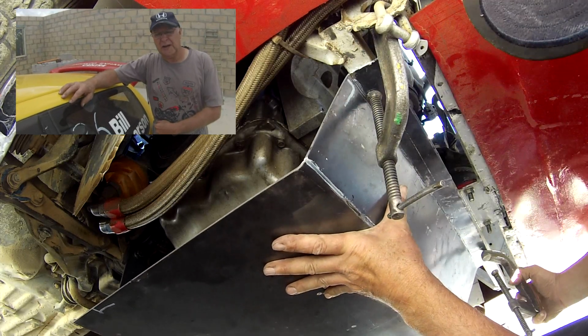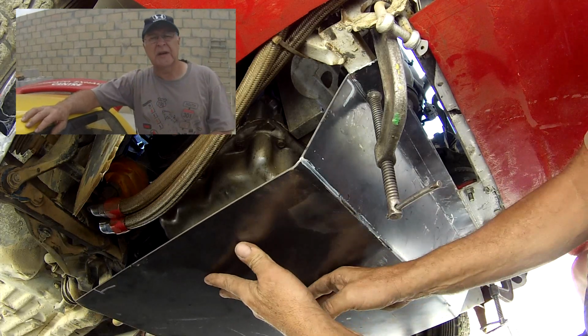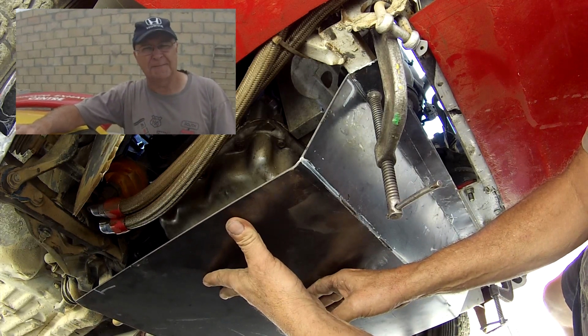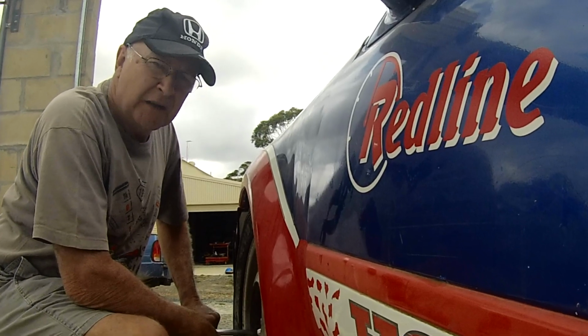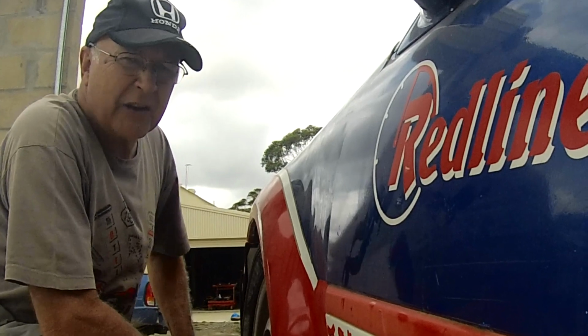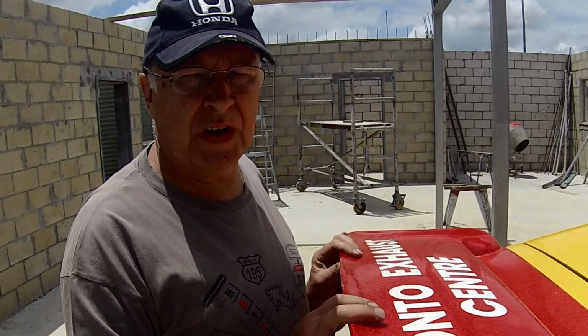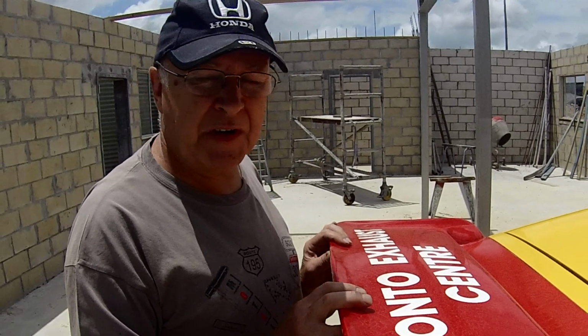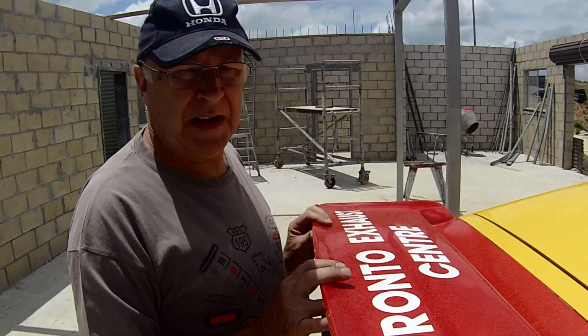With the plate loosely in test position, work out where you can put strengthening strips to help keep the sump guard flat. I prefer to not cut holes for the drain plugs in the skid plate because these tend to catch on rock ledges. Race cars don't do many kilometres in a year, so I prefer to just drop the sump plate to change the oil when I do my annual tear-down inspection.